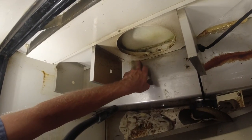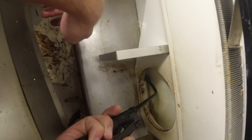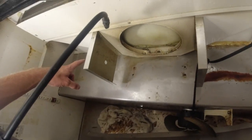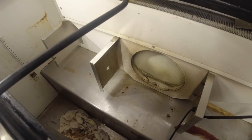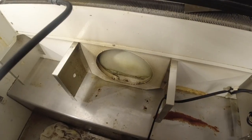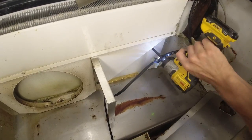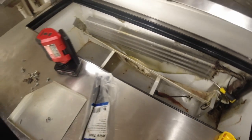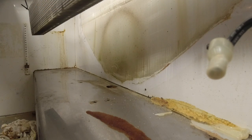Down here - this should all be sealed here and back here. It must be coming through - you can see it all right here. What are you going to do about it? Silicone it. Unfortunately it's got to be perfectly dry or it won't stick. We've got to take all those screws out, remove the old silicone, and then re-silicone it. I'm just going to run a couple of zip ties. Using a plastic wannabe razor blade that way it's not destroying the metal.